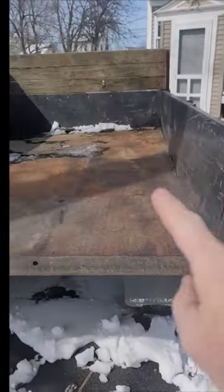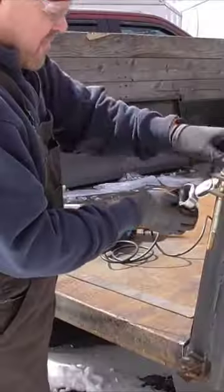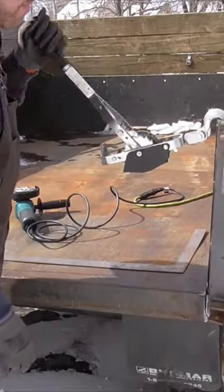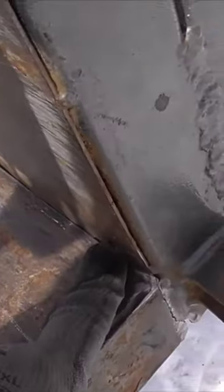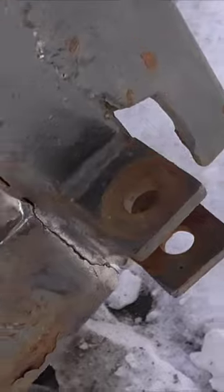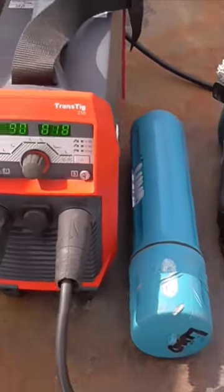So what we're gonna have to do is come along this back together over to probably here, get that all welded up. Weld it right here in this corner and then let the tension off — now it'll close that gap back up. Plus we've got to V that out too. Try it right about 90. That's gonna be hard but we'll try it.